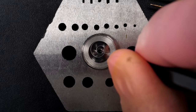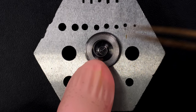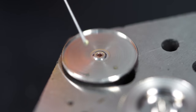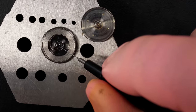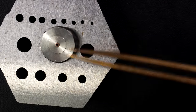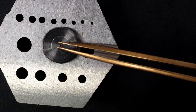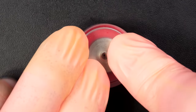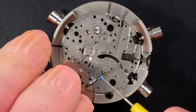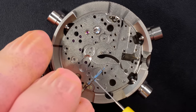Because it's an automatic watch, the mainspring will keep rotating on this wall, so that's why it needs to be greased. The same on the bottom before we put the mainspring in. I'm going to put the barrel arbor in position, greasing the top lid before we close it. Here we go, perfect - now it can be closed. Using a special tool, just placing it in and with a gentle push it is closed.